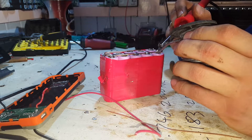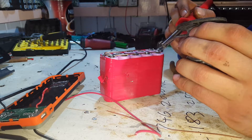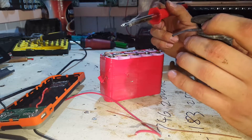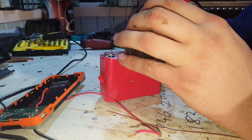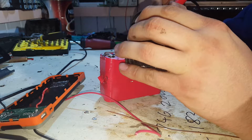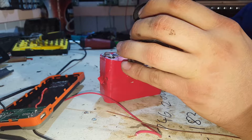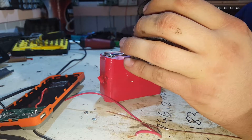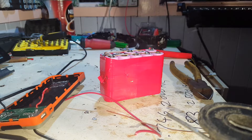I'm not knocking it because it is good, don't get me wrong. But if it's only running a - I'm not sure exactly on the spec - say 2000mAh cell and it's pulling 2 amps when it's working hard, like the old S5s did. I've got a read of it pulling 2 amps. Run times are going to be under an hour just because of degradation. So it's something to keep in mind.